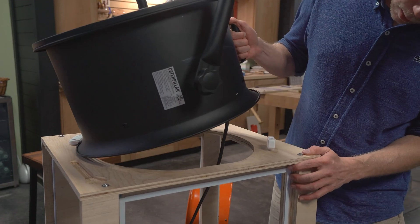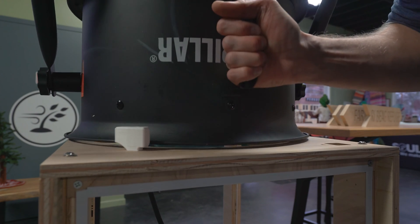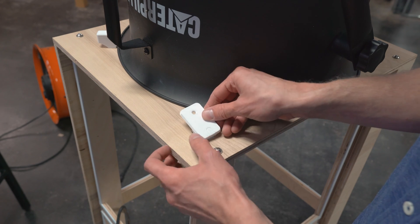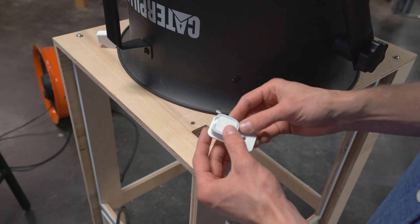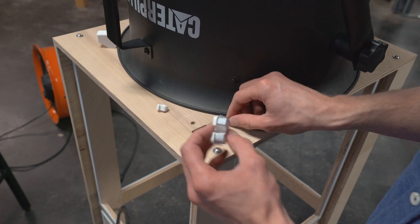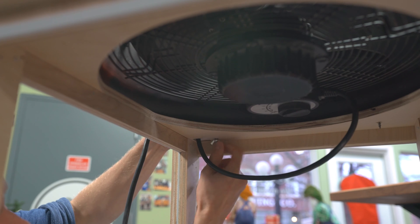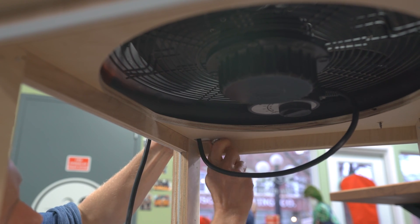Now you can unlock the fan, lift it up, and turn the dial. The power cord cover has two modes. If you are using the push configuration, install it like this. If you have the fan in the pull configuration, you will need to remove this key from the cover. Now run the plug through the opening, slide the cord into the slot, and insert the screw. Leave some slack on the power cord inside the box, and thread the wing nut onto the screw.